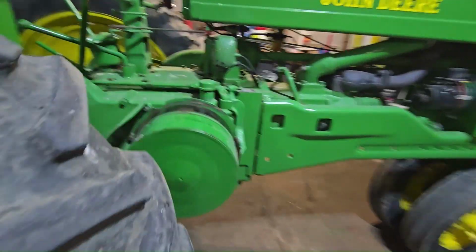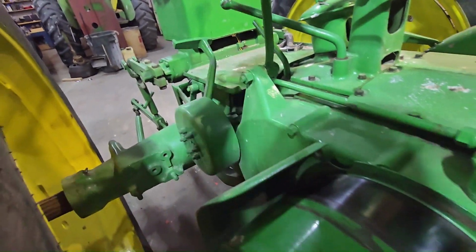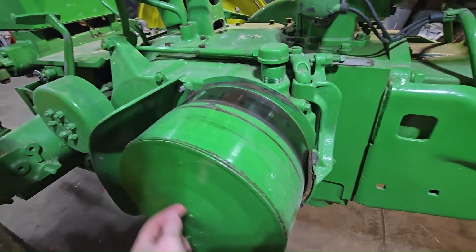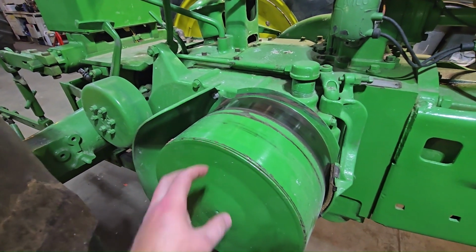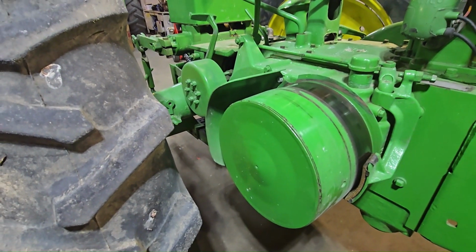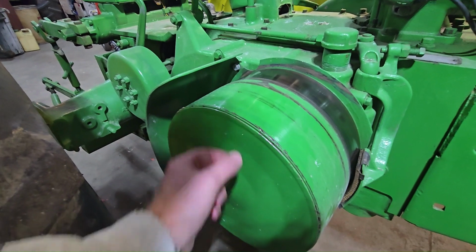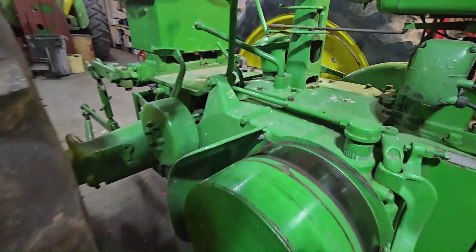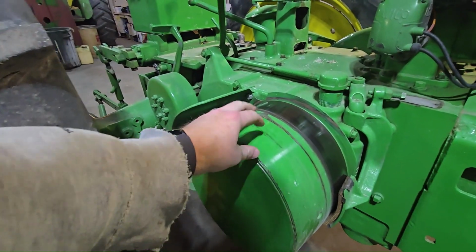So the issue with the clutch is it's really, really loose. It takes no pressure to engage and disengage that clutch. And I know that I can just tighten the 3 screws down in here, not screws, but the 3 nuts. There's some castellated nuts down in here that adjust the tension for the springs that clamp the clutch discs and the pressure plate together. That's not hard, but the problem is if I turn those screws from where they are right now in the super loose position a quarter turn tight, then the clutch goes from being super loose to being so tight I can't even engage or disengage the clutch. So something is wrong down inside here, and I've got to figure it out.